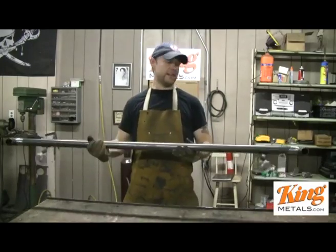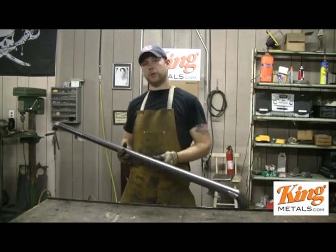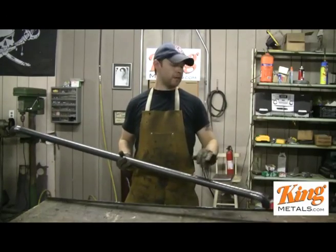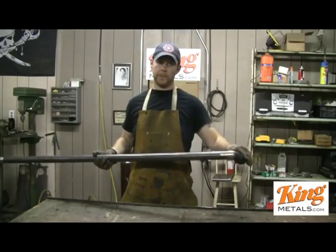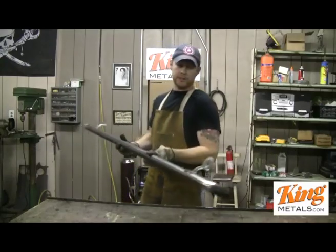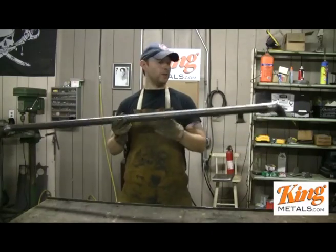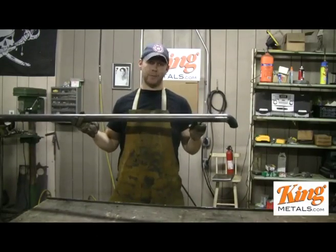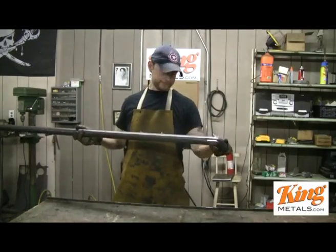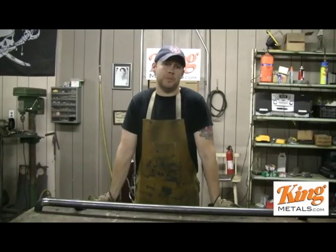All I have to do is come back and finish up these welds, do the same on the other side, and we have a perfect railing. All we need to do is prime and paint this thing and go install it — a very, very simple railing to put together. Having these curved pieces makes everything so much easier; you don't have to worry about finding a shop with a tubing bender. You'll also notice without the brackets this looks a lot like a tie-down bar for a truck — same process, only for a truck you'd put mounts on the bottom. I'm Andy Fogarty from theathomewelder.com and I'll see you next time with more tips and tricks for the beginner welder.